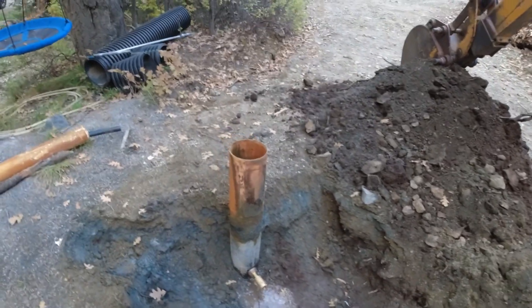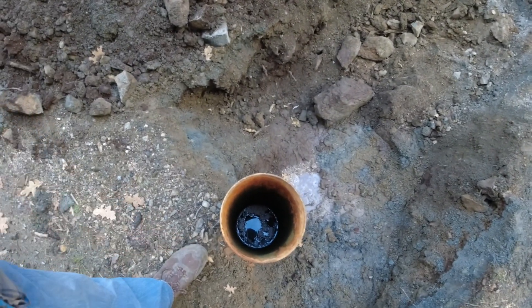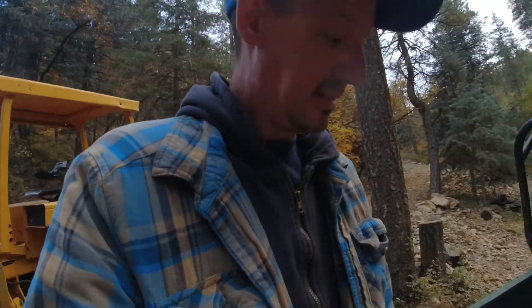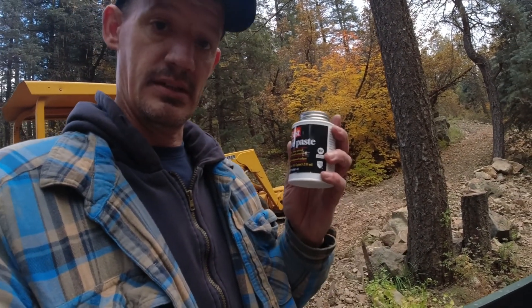Alright, so we got the pitless adapter in. You can see it down there. I put a check valve on there backwards so that the water would rise and I can get the rest of those shavings out of there. Since our well is artesian, that makes it kind of nice — it comes up to the top and I should be able to just scoop those out. We built the adapters. I put together the other side of the pitless with the barbed side, and here's my nipple to check valve to barbed adapter going into the pump. Using sealing paste instead of Teflon tape.